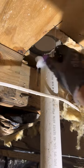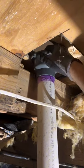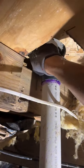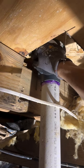This is an easy repair being in a crawl space, because I can just glue the shower drain on from underneath, put the gasket on from down here, and then tie it in once I go up top. Would a second person help? Sure, it would make it a little bit easier, but it's definitely not necessary. When you work by yourself enough, you just get used to doing things on your own.